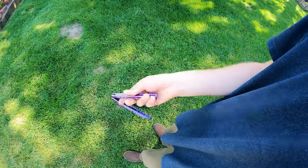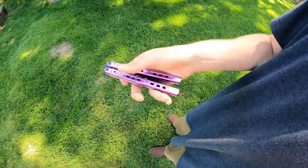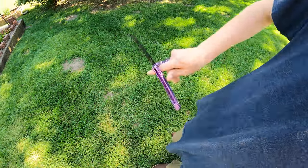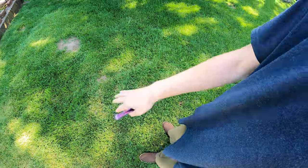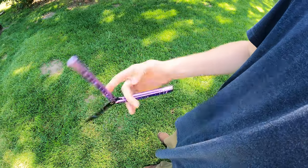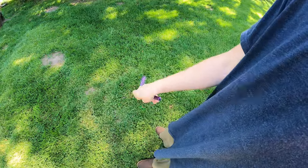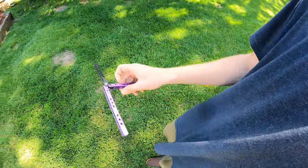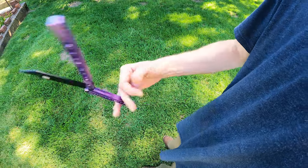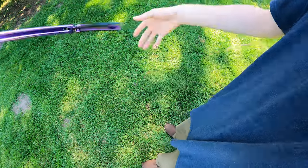You want to just slowly keep tightening to the point where the handles bind, and then slowly back off just to right where you get free swing back — that's the sweet spot. Now, if you had already applied your Teflon tape, you don't have to do anything else. With Loctite, if you go too far and didn't check to make sure you have free swing, you have to break the Loctite seal and back them all out. With Teflon tape, you don't have to do that. Definitely use Teflon tape.